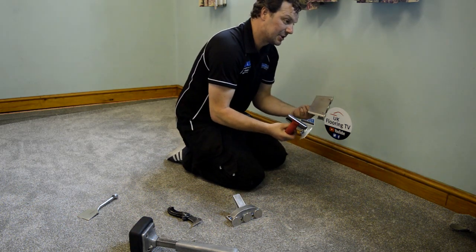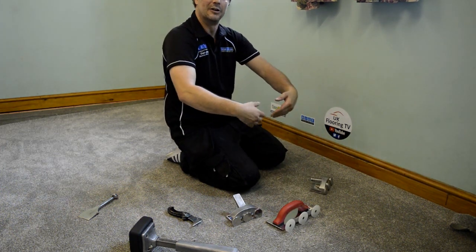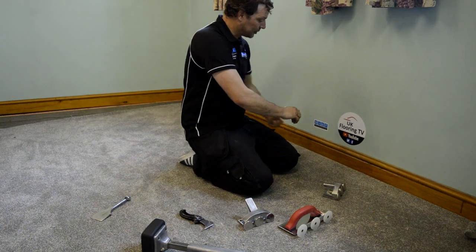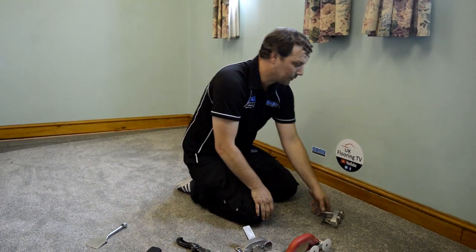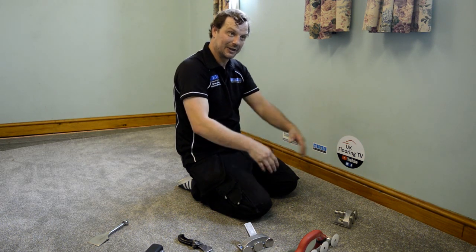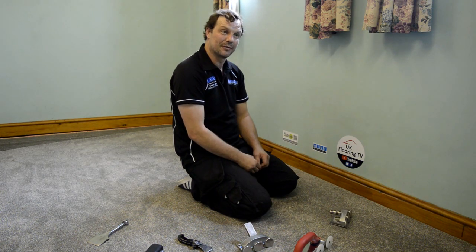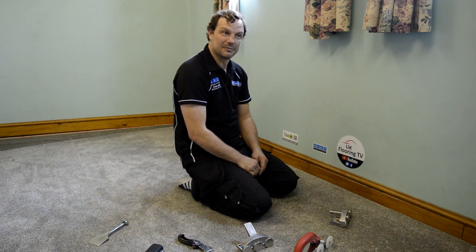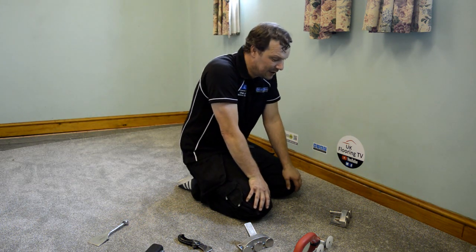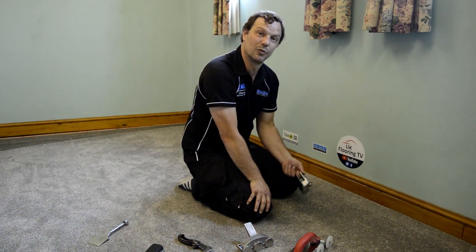The thing I would say about these — when you come to fitted units in a bedroom, you've got some wardrobes with one of those plinths that moves in and out. The trimmer gives you a good cut, but when you tuck with one of these, it doesn't tend to move the plinth away as much. I'm quite impressed how you could get these flimsy fronts of wardrobes and use a tool like this, and it tucks it in nice. Sometimes it's impossible with a moving wardrobe bottom to get it to tuck nice. This is the best thing I've got in my tool bag in recent years and I wouldn't be without it now.